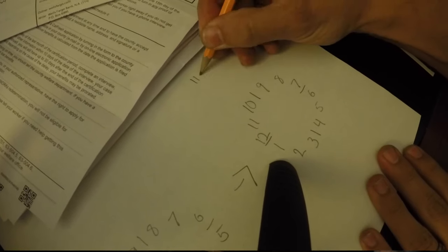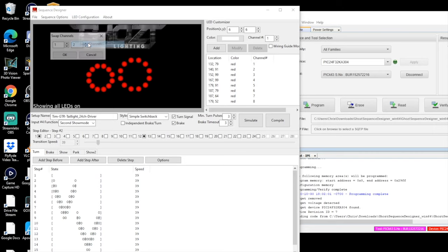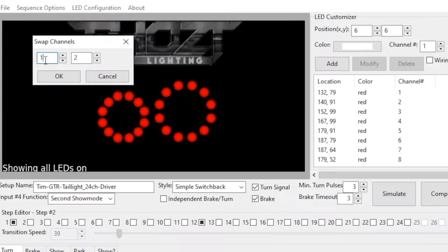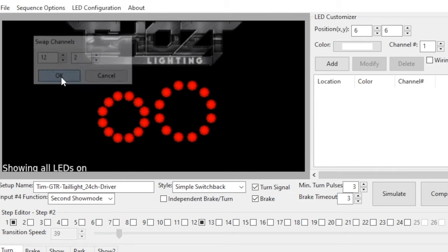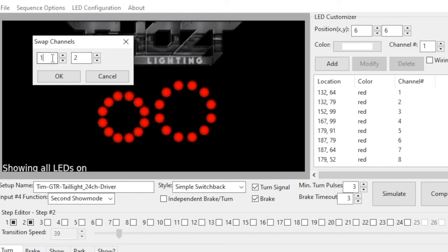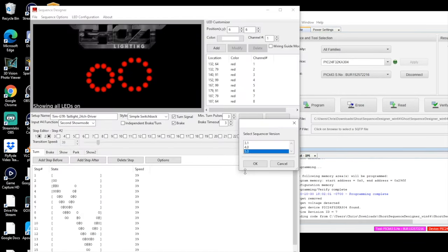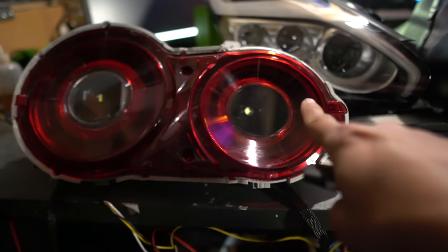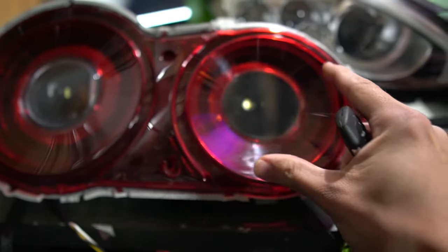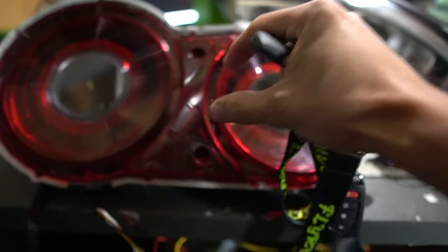I had to write it down on paper so I could understand what needed to be done. I need to swap all these things around in a very particular way. The first thing I have to do is swap channel 12 with channel 1. Then I have to change channel 12 with channel 2, and then change channel 12 to channel 3. I have to go all the way around the circle. I'm going to compile it — I think it's going to work. The idea is that instead of starting at a weird angle and fanning out diagonally, it should start right here and do it like it should. Let's find out.